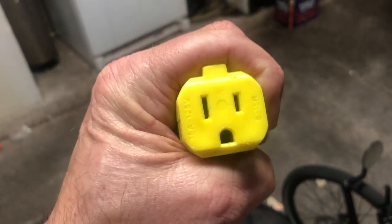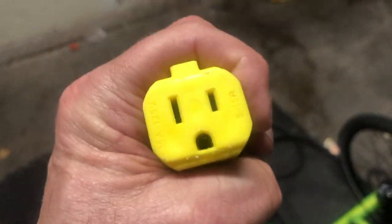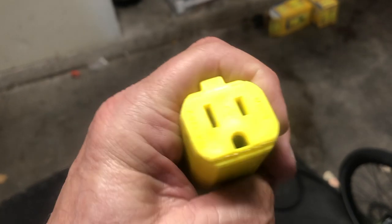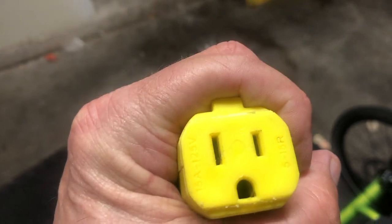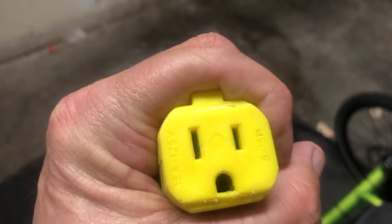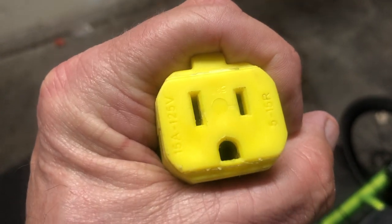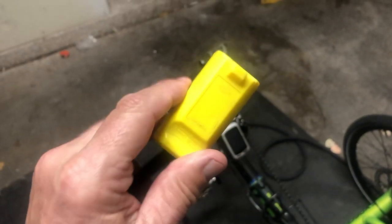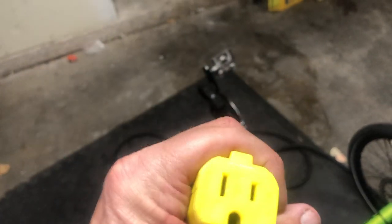So just remember your two top prongs are going to be your black and your white wire, and the bottom one is going to be green. Now you have your 120 outlet. You want to make sure that you line up your colors correctly. Usually on a regular 120 you'll have the left side as white and the right side as black, as we're looking at it this way. So you can align your wires that way.